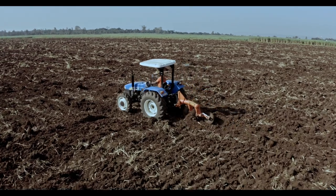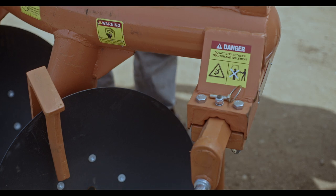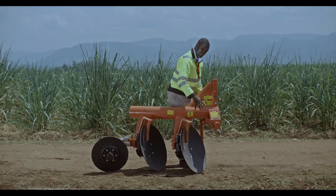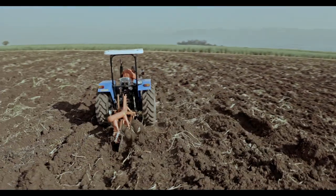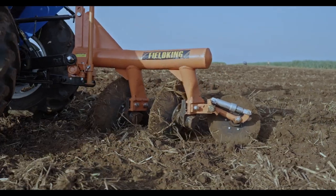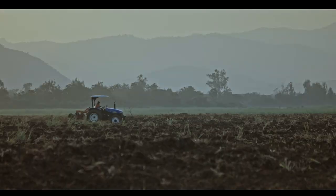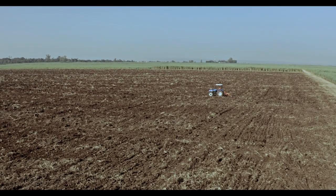Then we go to the hexagonal crossmember, which is designed to have dual locking to make sure there's no twisting process which affects the width of cut when you're ploughing. There's a bolt here for adjusting the width of cut from 0.8 meter up to 1.2, depending on the situation of the ground you have. Compact soil, narrow cut; regularly tilled soil, wide cut.